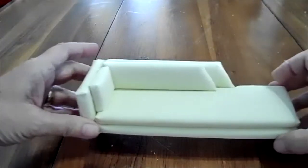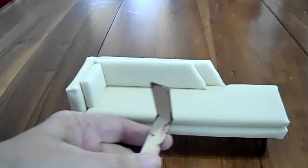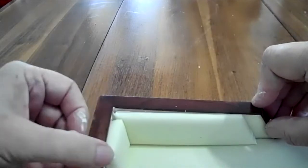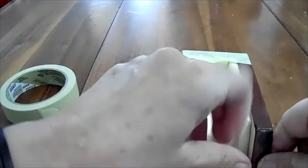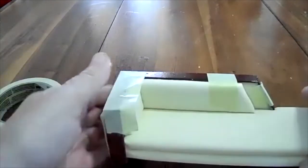I've let the base dry and now I'm going to put on the trim on the top edge. I'm using wood glue because it's a structural element and will help make everything solid. I don't want any messy edges so I'll be careful about wiping up the excess. I put it on and use masking tape as clamping, then let it dry as long as I can stand. Make sure the masking tape is nice and tight — sometimes you have to lift and reapply it. You can also use painter's tape or clamps if they work, but I find clamping doesn't always work on this kind of thing, and with fine fabric and leather you don't want to leave a mark.